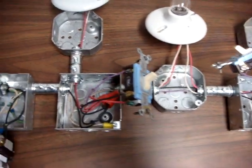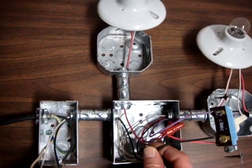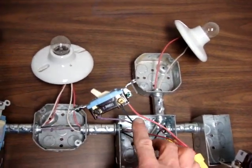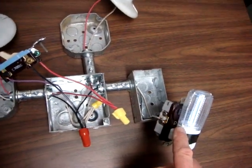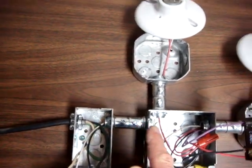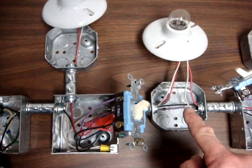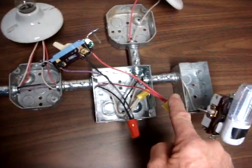The other two terminals on the three-way switch have the hot wire, which comes from the outlet, continues through the light box, feeds the other three-way switch and a traveler terminal, and continues on to power the other outlet. The white wire — or neutral wire, or grounded circuit conductor — comes through, is spliced, goes up to the light, continues on through to the next light, and to the final outlet.